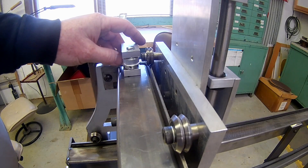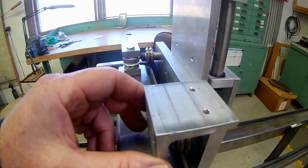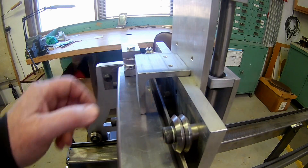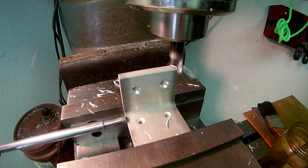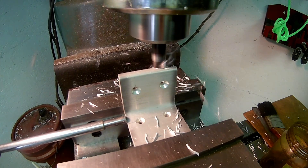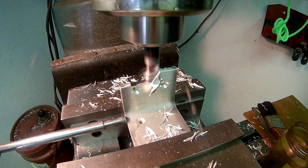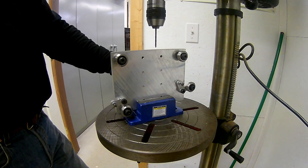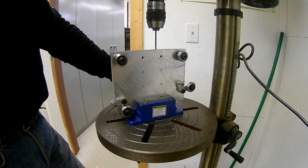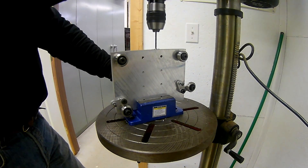Next I turned my attention to making a way that I could rigidly attach the belts to the x-axis trolley, and I decided I would use these little pieces of aluminum angle that I had. Someone had used them as little angle braces but they were almost exactly the right size and they even had a couple of holes I could reuse. So I had to shorten up each leg a little bit to make them right — back to the mill they went and a couple of passes later they were all ready to go. This is the x-axis carriage and I'm drilling for a couple more threaded holes that are going to hold that anchor point on that I just milled out of angle iron.